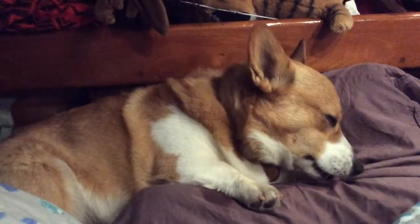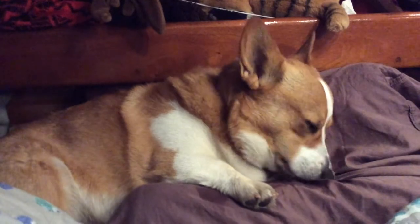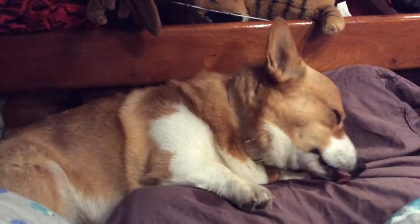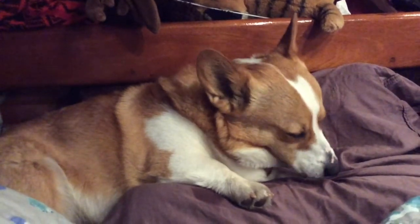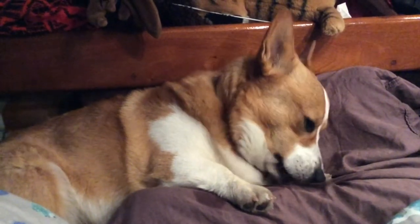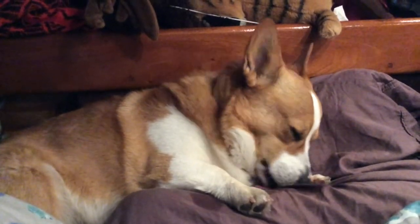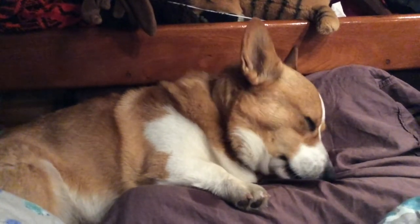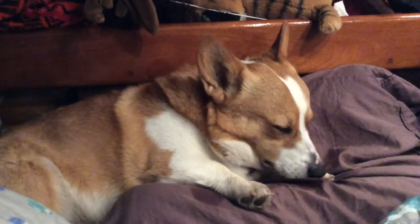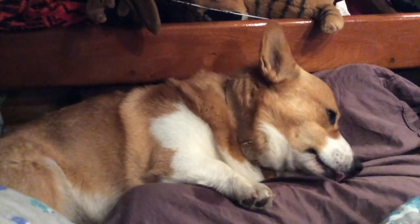Now we have all the floorboards up waiting for things to dry out. A neighbor lent me a fan, so I have it blowing into the bilges for airflow. My biggest concern is rot forming in the wood under the hull or floorboards, so I got everything open. I drained it all with the bilge pump, then used a shop vac to get every last bit of water, and sprayed WD-40 over all the battery terminals so they hopefully don't corrode.